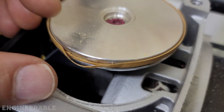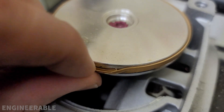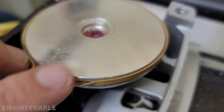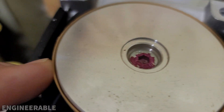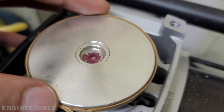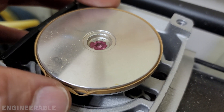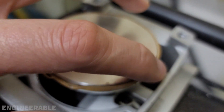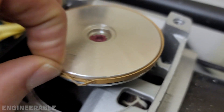This is what the piston cups look like, and why it was making so much noise is because the air was leaking out the side — this piston cup is torn. It just got really thin in some places, especially since these pistons kind of rock back and forth inside the cylinder. They wear more in certain places; this one wore prematurely here.